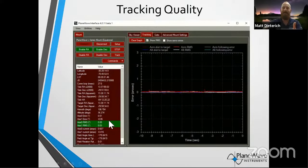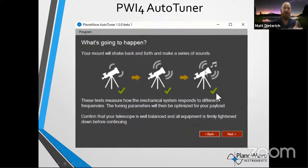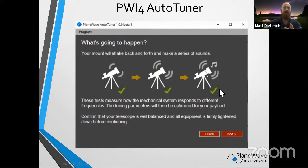This graph shows our altitude and azimuth motors on the mount tracking the night sky — fractions of an arc-second of error. That means crazy stability over the long term for keeping stars pinpoint because there are no gears meshing together. Geared mounts are usually one to two arc-seconds plus of tracking error, which means you have to autoguide and pay closer attention. But the software and mount technology allow for high stability and tracking. The auto-tuner Kevin wrote allows the mounts to be optimized for tracking, and clients can run that in the optimizer setup.